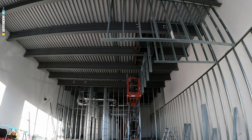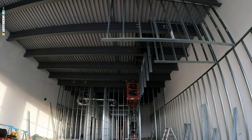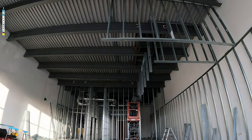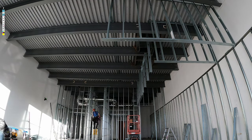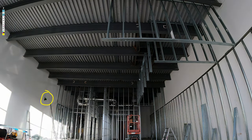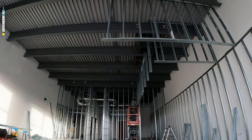We're going to put a 6-inch strip of drywall on the inside just to pick up the wall mold, and that's it. Okay, there's no actual reveal. The T-bar finish is flush. So what I'm doing now is I have a line laser. You can see over on the wall here. Okay, I've checked the elevations for the studs. That was the laser card, the green laser card. Because when I start doing track, I put a 2-inch offset, okay?